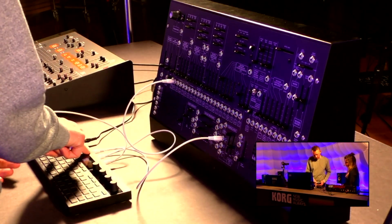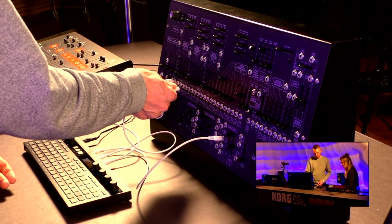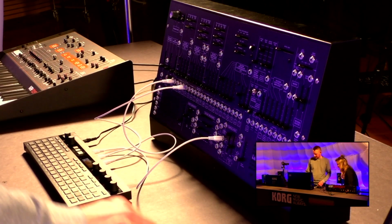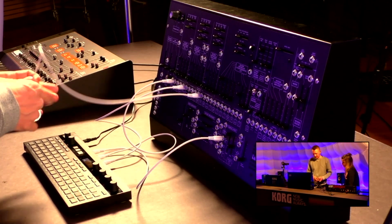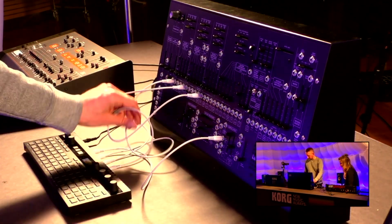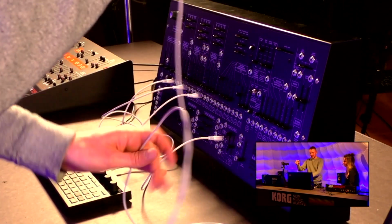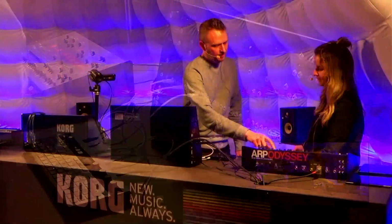So you can see the layout is also very convenient: mod, pitch, gate. We're just connecting these to the individual jacks here that take the keyboard CV, like so. What I'm doing here, a little different from the previous patches, is decoupling the pitch and the gate information. Normally when you hit a key, you expect the pitch to change and the envelope to open at the same time.